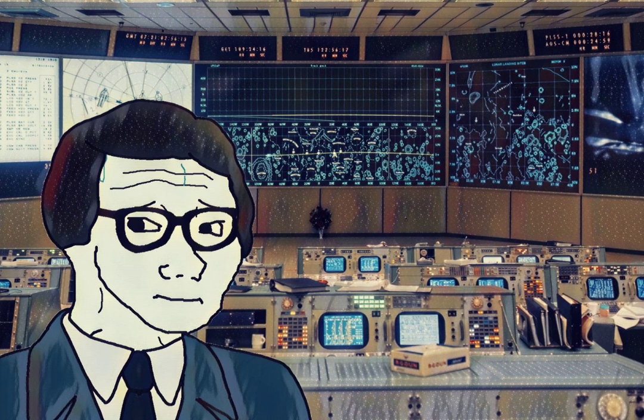He's flipping our fuel cells here on flight. Let's get some recommendation here — if you've got any better ideas. What do you want to do? Have you got a big sensor type problem there or what? Flight ECOM, go ahead. He's got fuel cells one and three offline. We've got main A volts — we have no main B volts. Have an attempt to reconnect the fuel cells.